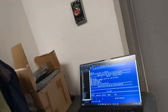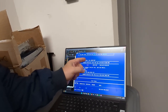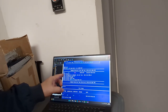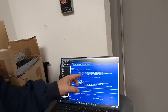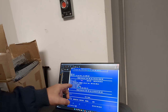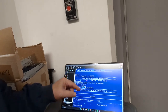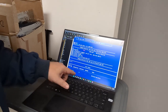After knocking down the camera and all that good stuff, I'm back. What I did is I ran: show interface gig state, and piped it to include link flap. It showed me that port 2.4 was administratively up, operationally down, due to link flap. So I went into configuration mode, changed to that interface, did a shut and a no-shut — also known as bouncing. Then I checked the status again and it showed it was up.